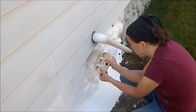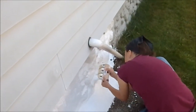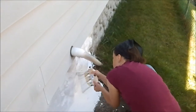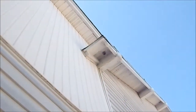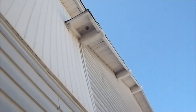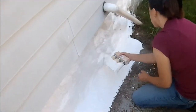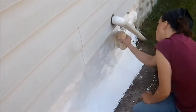Right. But this side of the building really doesn't get much sun. I was out here not long ago at dusk, checking to make sure that the cement had cured, and the sunlight ends right where that pipe is. The sun just does not go any further. And if you look up, that roof sticks out further than the section above it. So you have this combination of not as much water protection in this section, and then zero sunlight in this section. So it's the perfect environment for moss to grow in. It's like this perfect storm of poor conditions for foundation health.